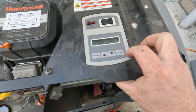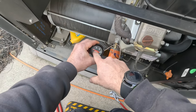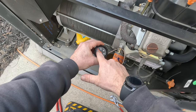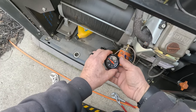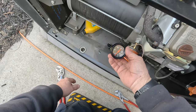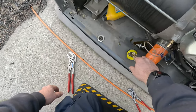Okay, so we are going to the off position. Hit enter to acknowledge manual. Oil pressure — plenty. No problem whatsoever. That should not drop out. So the problem is the gauge — or the switch. The switch is your problem. There's your problem. Yippy skippy. I don't have one.